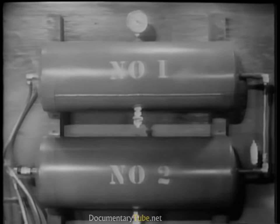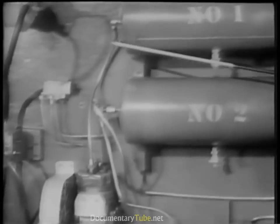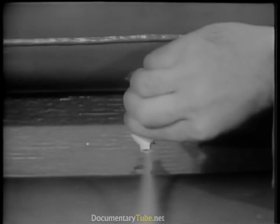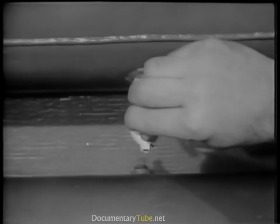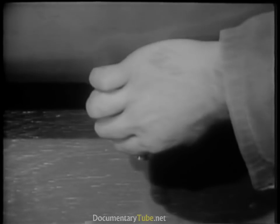There are two reservoirs in this air brake system. During compression, the air is heated. As it flows through the lines into the reservoir, the air becomes cool and its moisture condenses out into water. The first reservoir is called the number one, or wet reservoir. It is mainly used as a moisture trap in which nearly all the water can be collected and drained away when necessary. The number two reservoir, the dry reservoir, drains off the remaining water and supplies dry, compressed air to the system.